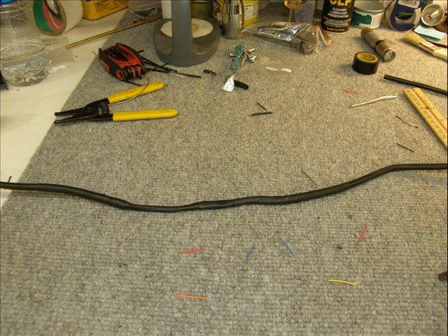To finish up, if you did the first step correctly, you'll have one foot of heat shrink to slide in place and shrink. When you're done, you're going to have pretty close to a factory original cable. That splice should actually be better than the connections that were originally there. If you want to make them a little bit more waterproof — if this wire is going to be in the bilge where it has a chance of getting wet — you might want to add a little liquid neoprene to the end of that heat shrink just to seal it up so no water can wick down in there, and you'll have a perfectly operational transducer wire.